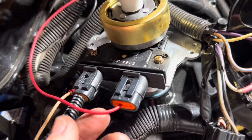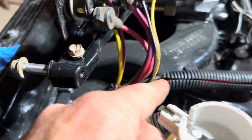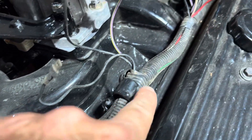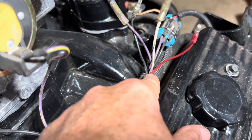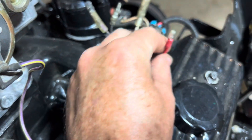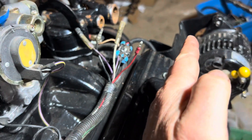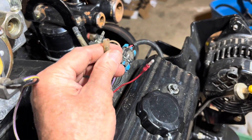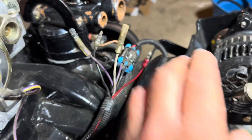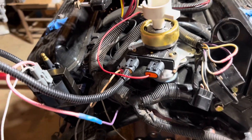On the shift-kill, I provide this harness — this plug with a red loop of wire. I've looped it around, put it inside the loom, fished it through the loom all the way through here, trying to make it clean. I'll wrap this tape, got it through here, then wrap the tape back around. This is my shift-kill signal coming from the shift-kill switch, which is on the riser on the starboard side. We've got 12 volts here — when the shift-kill switches, it switches 12 volts to this wire. Shift-kill is now done.